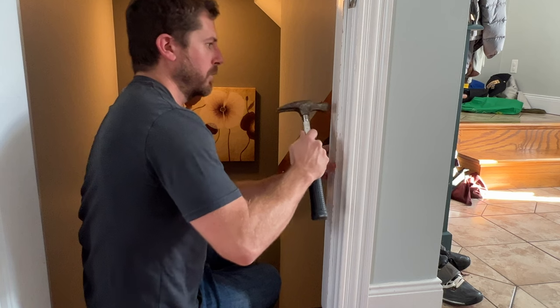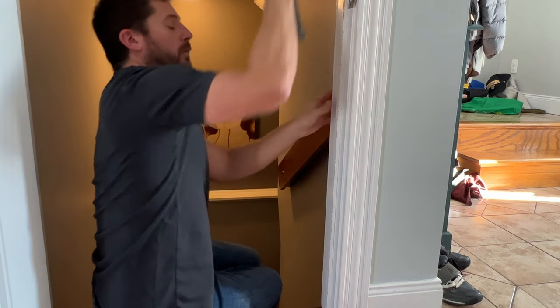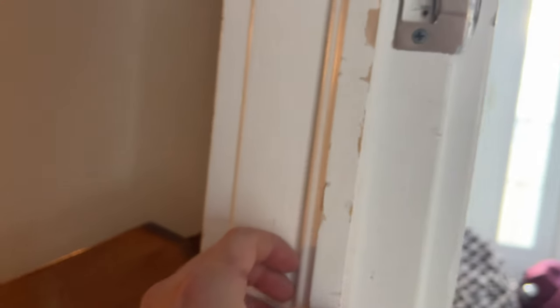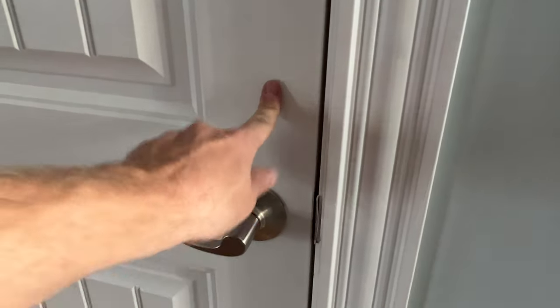As you can see, this one is not tight, so all I'm using is a few small nails and a hammer to tighten it back up. You can adjust it a little bit forward if your door is quite wobbly when it closes — just bring it forward a bit, fasten it back up, see if it closes tightly, and that should help with noise. Before spending any money, do that and see if it helps.